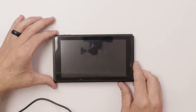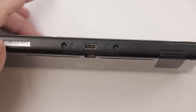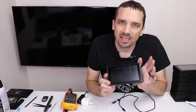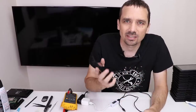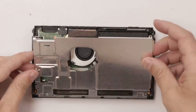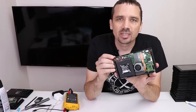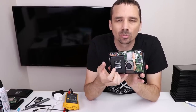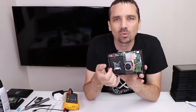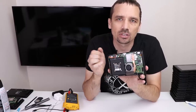Number 18 — let's see if it turns on. Definitely doesn't turn on. The charge port looks like maybe there's some sort of corrosion in there, which is not good news — we might have more liquid damage. But after getting the back and metal plate off, there is no liquid damage. Since there's no liquid damage but the USB-C port looks dirty, I'm going to disconnect the battery, clean all the pins on the USB-C port, and test the capacitors around the chips to see if any are shorted. We've got a short there.